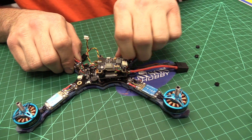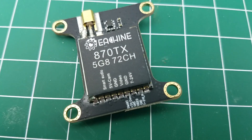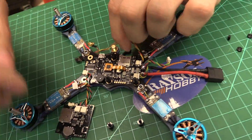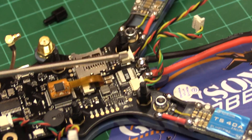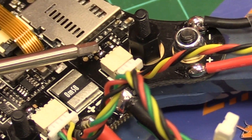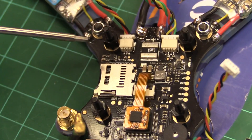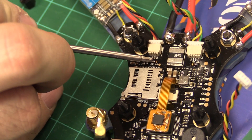For maintenance and working on it, this is actually a nice feature because it's not hard to work on. Now we officially know what VTX it is — the Eachine 870TX, 72 channel. It's got the diagram for all the wiring. If we want to rewire and bypass the SD card DVR, we can. Here's the guts of the IDC DVR-638. The UART1 port is where the receiver is pre-installed. This does feature a 3-volt or 5-volt selection — if you unbridge it, just like an Omnibus, just like the Wizard 220S, you can desolder from 5-volt and move to 3-volt to power something like a Spektrum satellite.